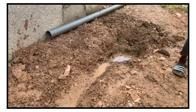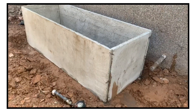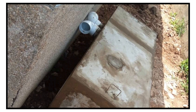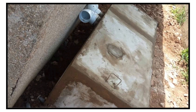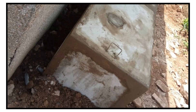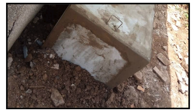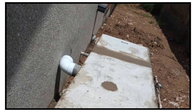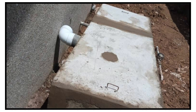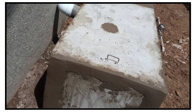We perforated the base of the pipes so that the wastewater coming from the digester can always have a place to go. The reason the biodigester works in such a situation is when you do not let the digester go deep down and the pipes are up. The inlet is up, the outlet is just on the surface — you do a drain flow system with a small drainage system.